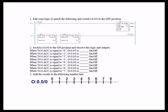We have a greater than or equal to instruction comparing the accumulate register of T40 to N70, which has a value of 2, and then comparing the accumulate again to N71, which has a value of 5. For this rung to be true, both instructions have to be true — in other words, the accumulate has to be greater than or equal to 2 and less than or equal to 5.